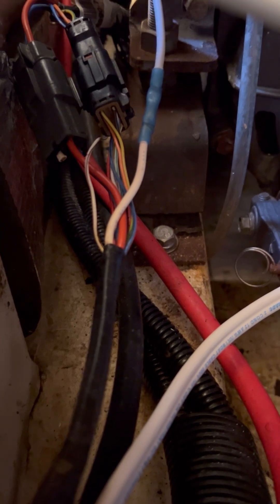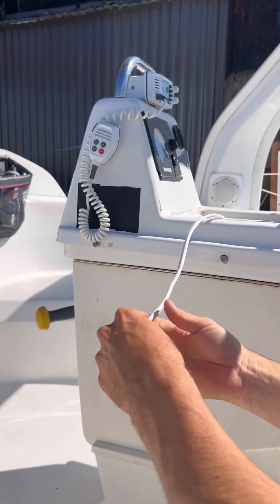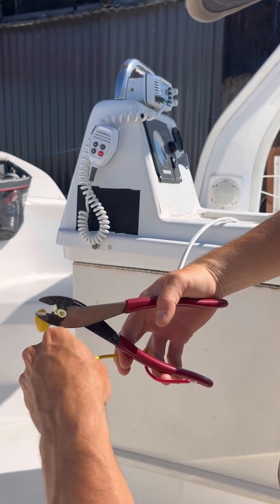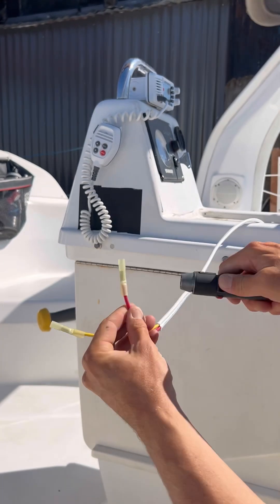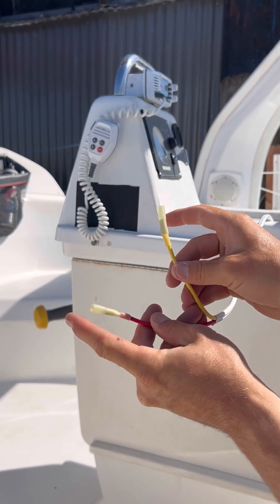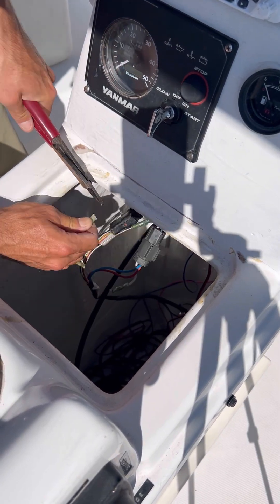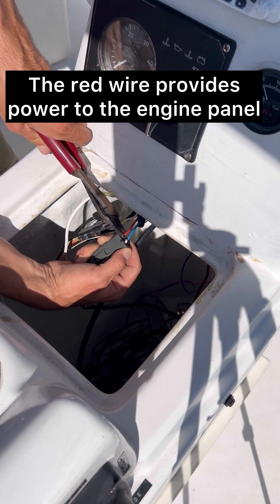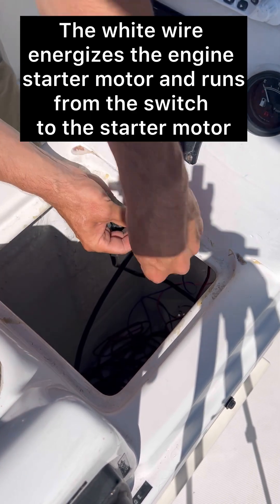The wire harness has the red and the white lines on it. We're going to start up here in the cockpit and splice red to red, white to yellow. I'm going to bypass — I'll clip the white wire here since I don't have a lot of room to work with. The other one is this red wire here — I'm going to cut it as close to that connector as I can. Now I've got just a little bit of room to work with this red and white wire.